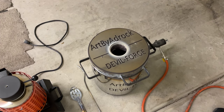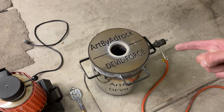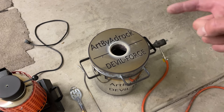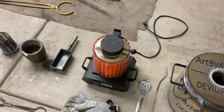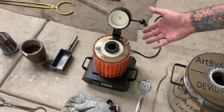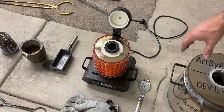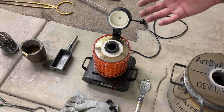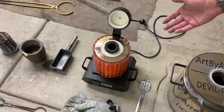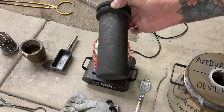That's the first way to do it - I would recommend it unless you're only melting a little bit of silver, zinc, or aluminum and don't need something this size. That's where I would go to the electric one, which is this guy right here. The one thing I like about it is it's small, compact, and temperature controlled, which is really nice - you can't really control the temperature in a propane one unless you have a pyrometer to test what it actually puts out heat-wise.